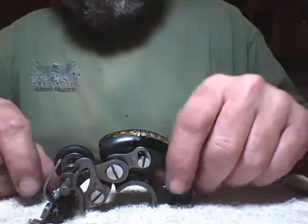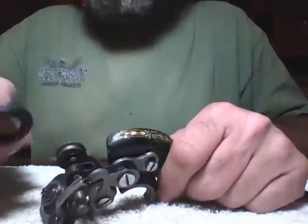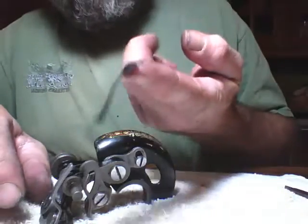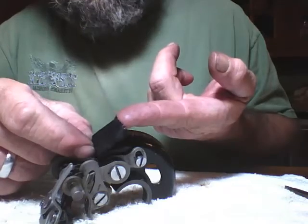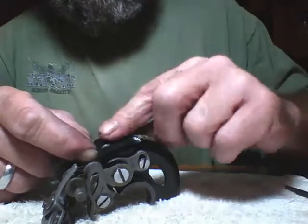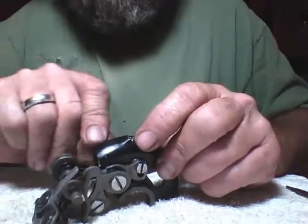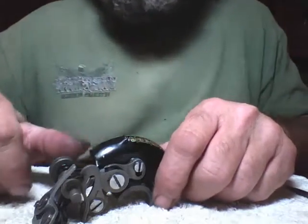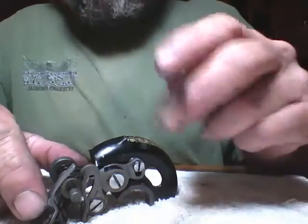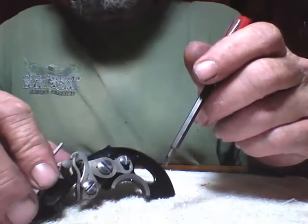These things are a jigsaw puzzle once you take one apart, and the only way to clean them good is to take them apart. I'm going to pop that tire off. Next I'm putting a piece of electrical tape right here, touching the back side a little to keep it from sticking to the decals. The reason we're putting that on is because what we're going to do here will scratch the paint off — I guarantee it will. Also, this camera is reversing everything — these are not left-hand threads, but everything will appear to be turning left-hand.